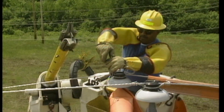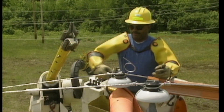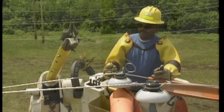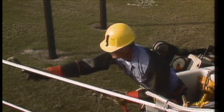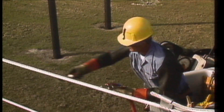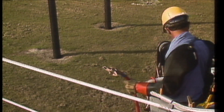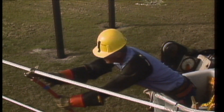To be prepared, you must be aware of the electrical hazards associated with working on 34.5 kV lines. You must also be able to positively identify 34.5 kV circuits and equipment on a system that uses more than one distribution voltage. Compared with 13.2 kV lines, the higher voltage level on 34.5 kV lines may create a greater hazard if a phase-to-ground or phase-to-phase fault occurs.